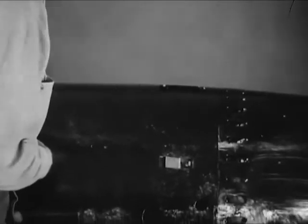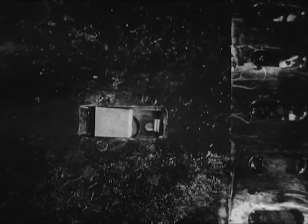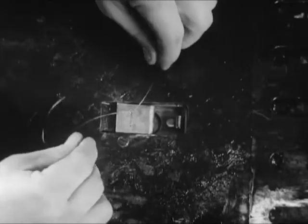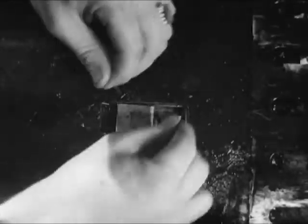A valve — the water trip delay valve — prevents the torpedo turbines from burning up during its long air travel. On leaving the plane, the torpedo is operating only by compressed air. Impact with the water trips the valve, starting normal fuel operation. This valve is secured with wire to prevent the airstream from springing it.